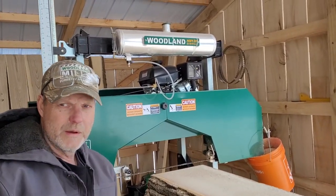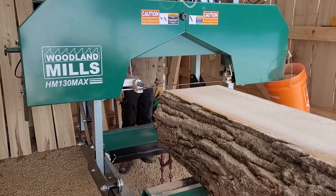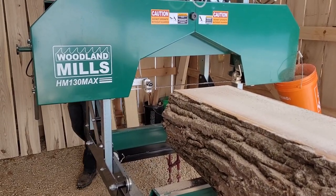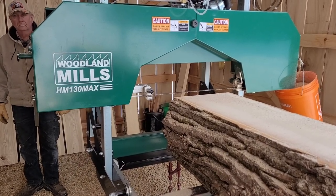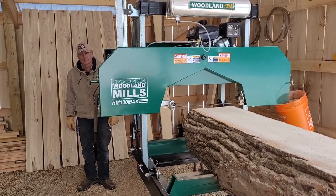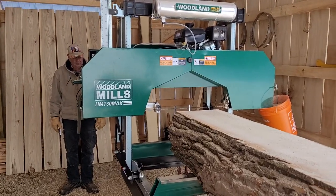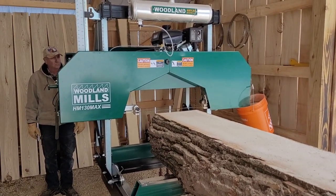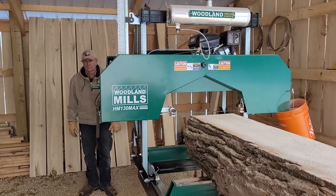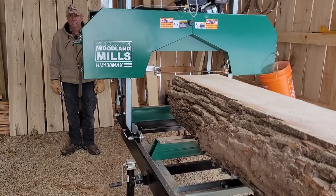Wow. So do you have antifreeze in that right now? I don't run any lube. Oh, you don't? Well, I don't run lube because I don't run pine trees. I don't have pine trees. And hardwoods have enough moisture in them already. No kidding. My opinion is if you don't need lube, bro, don't run it. It's just something else to worry about. All it does is make the sawdust sticky. It sticks to everything in there. But if you're running a real green pine or a tamarack, or I guess you call them larch out in your part of the country, you have to run lube with them because there's so much pitch that it builds up on the blade and then the blade binds.